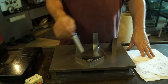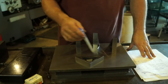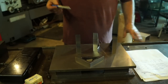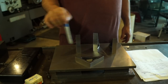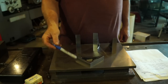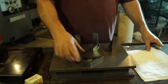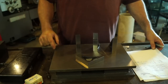So there's one good side and there's going to be one side that's off. The other 45 turned out to be 45 degrees, 0 minutes, and 7 seconds, which translates into about a tenth that it's out over five inches. So the setup was good — probably the side we set up on was good. The 90-degree corner is where we had the issues, and that's what needs to be corrected. I'd give B3 a B-plus for grinding.